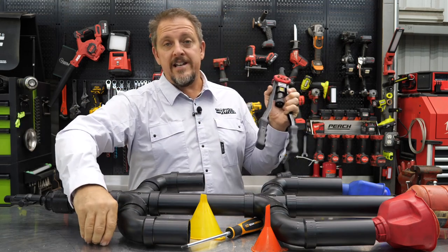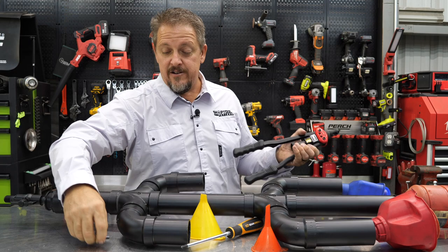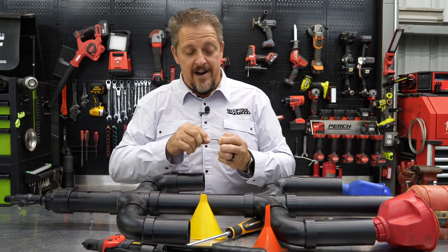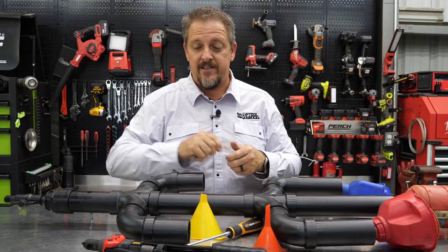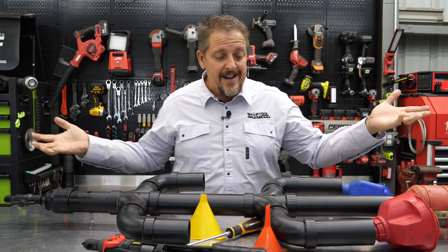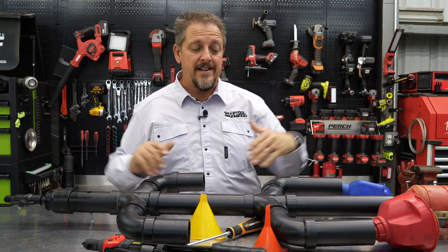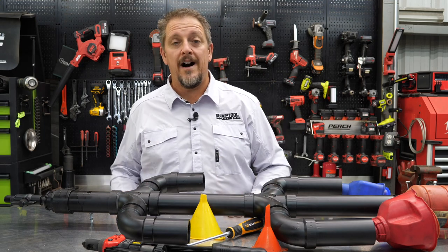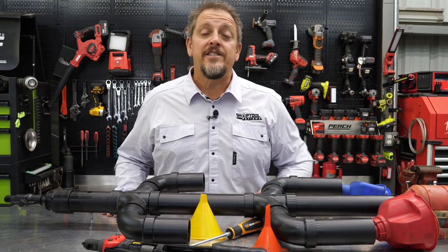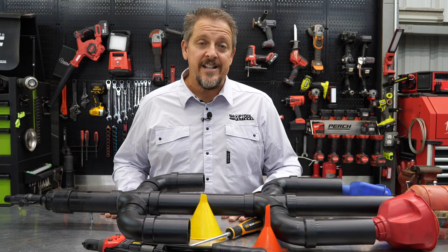We're getting a lot of use out of this little rivet nut tool — you take these rivet nuts, drill holes in sheet metal, and place the nut inserts so you can just screw screws through it without welding a nut or accessing the backside. It comes in really handy; we've used it on several projects and there are different tips for different sizes. Anyway, that's our idea — what do you think? Give us some of your ideas. I know there are lateral versions with an angle, but I didn't have the lateral space — I had vertical space on the side of the toolbox, so that's what we did. Keep track of us on Instagram, Facebook, and Twitter, and if you haven't already, hit that like and subscribe button — but only if you liked the video. If you hated it, give us a thumbs down and let us know why in the comments. Have a great day, keep smiling.